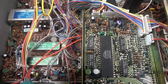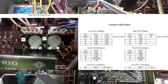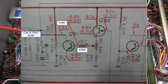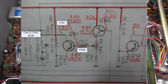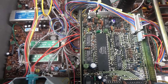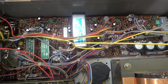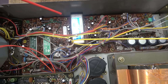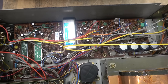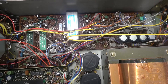I just simply took a picture of this area of the board, labeled my test points, performed some resistance and voltage checks, and it revealed that Q30, which is a 2SK19, is actually shorted. I went through my goodie boxes and located one — it actually crosses to a NTE 133, which of course is an obsolete part. Replacing that FET is a bit of a task. You have to remove the IF circuit card. There are several screws; you can swing it up out of the way. You may have to unplug some of these connectors. I'm going to get that swapped out and retest the 830 and see if we got ALC on that meter.